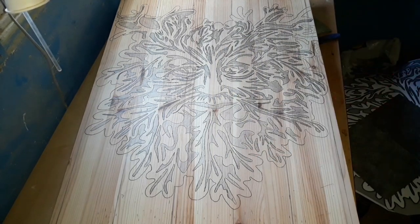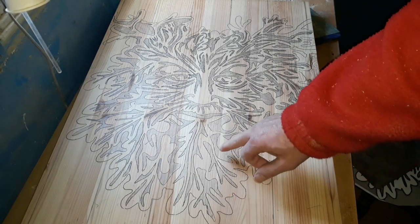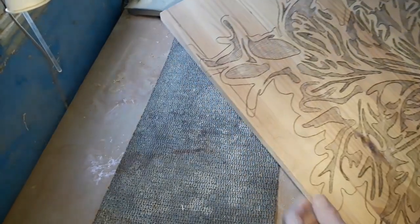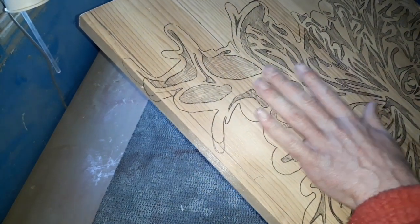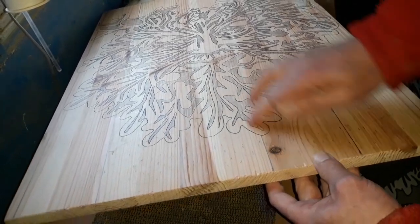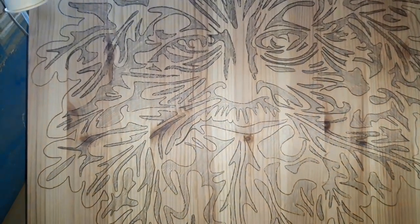It's quite complicated — there's a lot going on. We're shading the areas we want to remove, because you'll go away, come back, and start removing the wrong section. So we route out all the darkened areas. Then I'll cut a strip off either end because these longer leaves — I want them to bend over the end of the wood so they're showing on the side, like the ivy branches are growing over and wrapping around. Also there are five lines down here we'll route or scroll saw, just so it looks like it's on five pieces of wood with a slight gap.